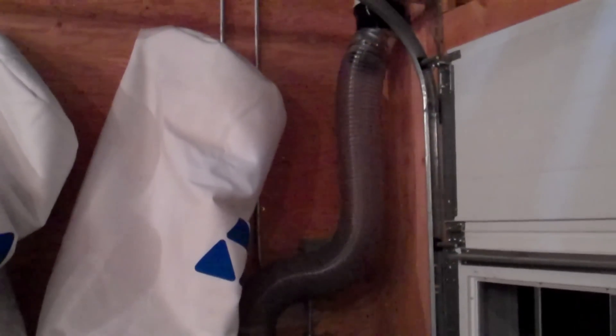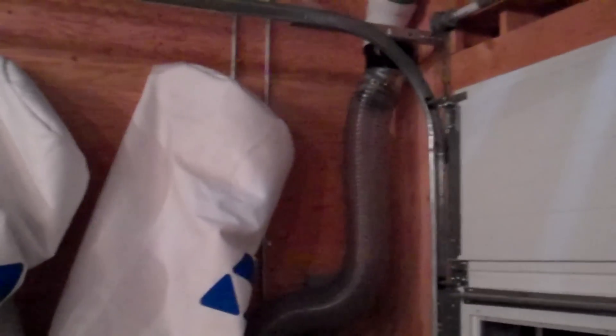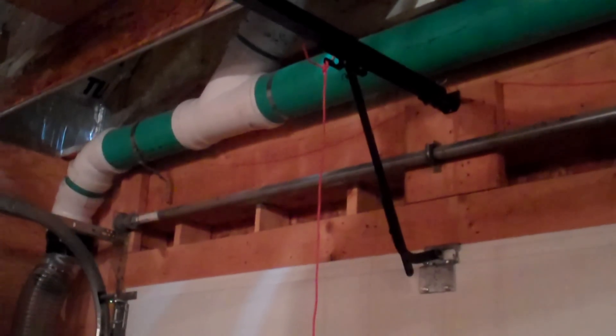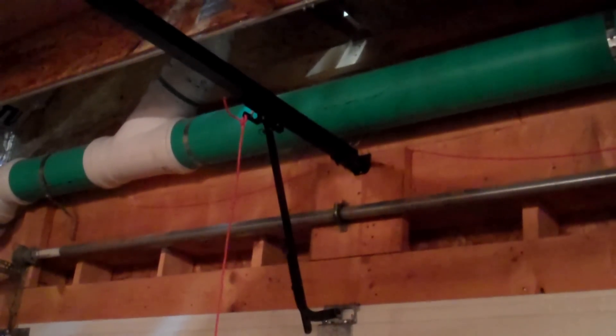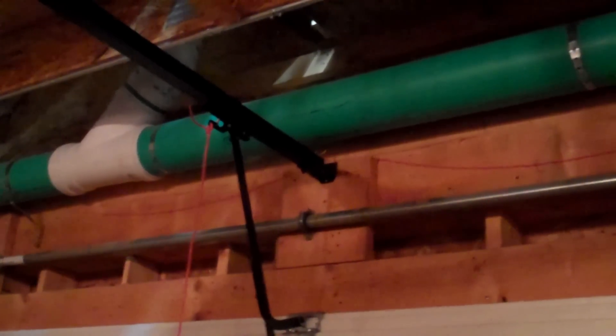Now I'm down in the garage at the dust collector. I'm walking around the backside of my pickup truck, but you can see the dust collection is set up to a flexible 6-inch hose that runs up — that hose is there just so I can pull out the dust collector, roll it around, and clean behind it. Then it goes up to a solid 6-inch PVC main trunk line. Here I'm using SDR 35 sewer capacity PVC line. It tees off to one side of the shop, converting to a 4-inch line that runs down one side of the shop.